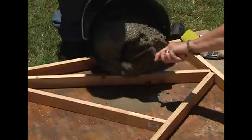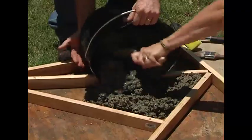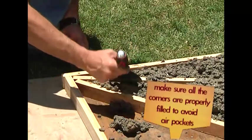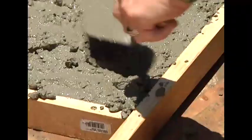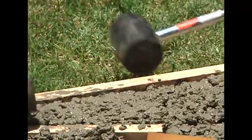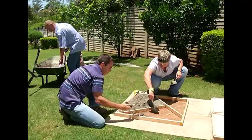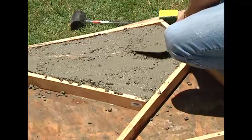After oiling the wooden frame and planks, pour the concrete mixture into the frame and use a trowel to get the mixture into every nook and cranny. The idea is to work it in as much as you can into the corners to avoid any air pockets. Then use a mallet to give it a good few bangs - as you do those taps you're getting rid of more of the air bubbles on the sides. Use a trowel to smooth and flatten the surface of the pavers.